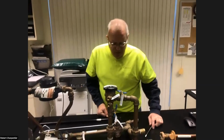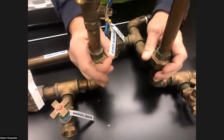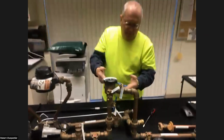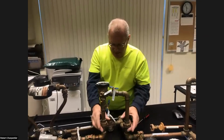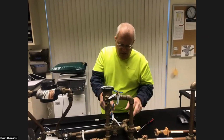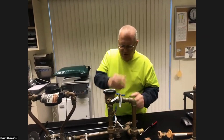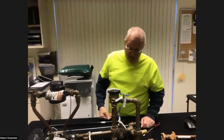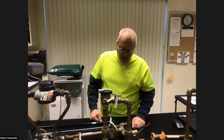One thing customers also do, you have union valves here. Many people, and that's what these are designed for, just loosen them up. This will separate from the pipe in the ground and the backflow. You just pull it up, make sure there's no water in it, put it in your garage, and you don't have to worry about it freezing. If you do that, make sure these pipes coming out of the ground are either capped off or covered so you don't get debris or bugs. You want to keep it kind of sterile because when you start everything up in the springtime, you don't want a bunch of debris clogging things up. But that's another way to avoid freeze in the backflow, because these are usually at least $100 or so at your plumbing supply. So they're not cheap. You don't want to be replacing this every year if you don't have to.